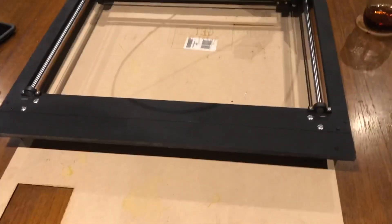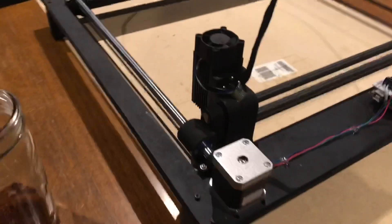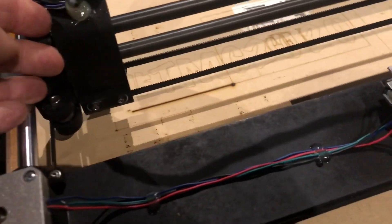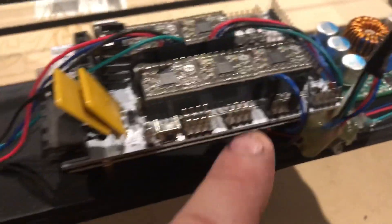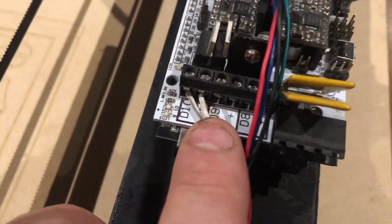So there we have it — that's the finished unit. It uses a CoreXY gantry, two stepper motors wired into a RepRap RAMPS Arduino board, Arduino Mega 2560. I've taken the bolts through so that we've got a clamping arrangement. Through the bottom of the cable there I've run the wiring for the laser power and TTL back to the board. Here we've got the pin driving the TTL and ground, and then the power is coming off location D10.